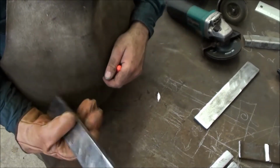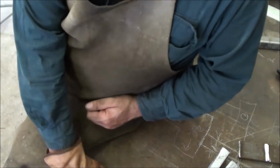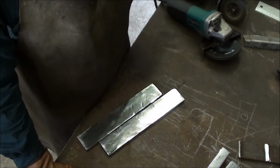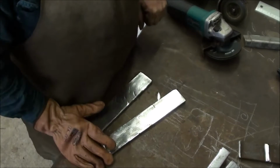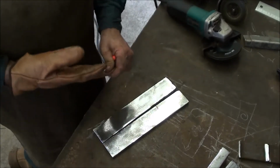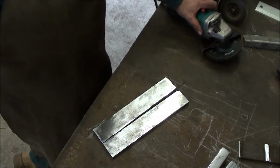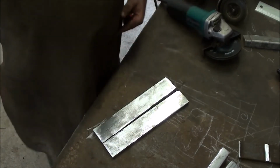Earplugs out. So as you can see, it rips into that pretty quick. Now, that's not actually my old steel, now that it's out of camera shot. Here I am, sitting on the bench. Now that it's back in camera shot, it's slightly better than my old steel. Normally my old steel is G250, 250 MPa material. This here is square edge, which means it's dual grade, 250-350 MPa, so 350 megapascal material, so it's a little bit harder. But yeah, as you can see, it ripped into that very quick, much quicker than a grinding disc, and a lot better finish. So yeah, we'll get on with doing other stuff now.